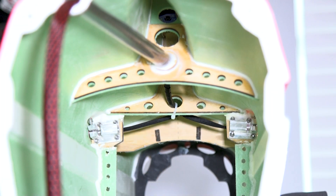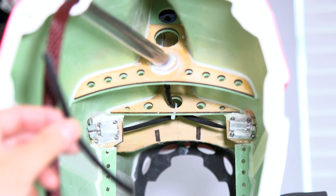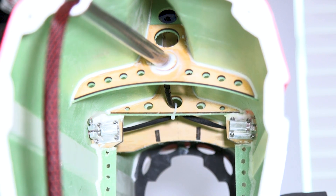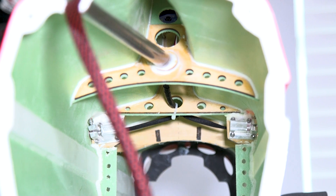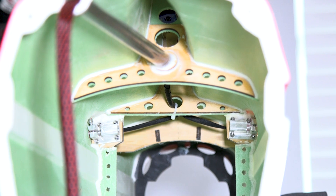What I did was use some thermal tape to insulate the elevator servo wires, then put a wire loom around them and zip tied it to the former so it doesn't move in flight. I also added heat-insulated wire looms around both elevators and the rudder wires, which will route forward to the front of the aircraft. We're now pretty much insulated from heat in the tail section and ready to put the thrust tube back in.